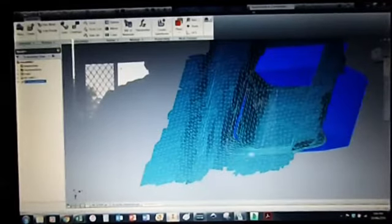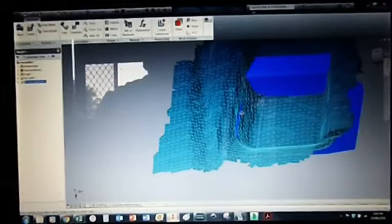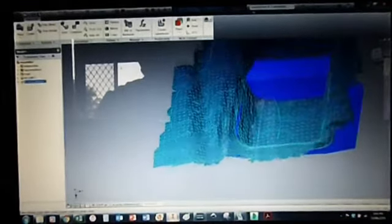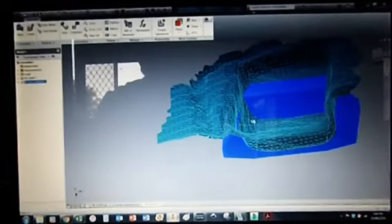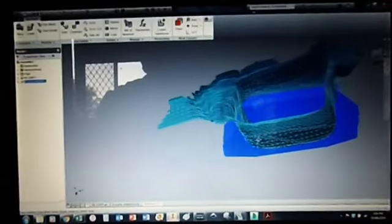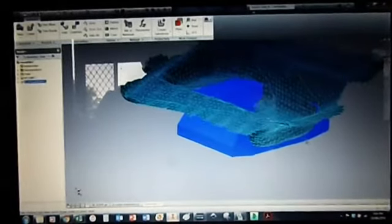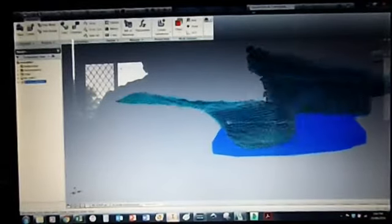Sort of playing with the idea of putting a separation plate in both sides of the wings. Just trying to make it harder for the oil to slosh away from the pickup. Just be like a plate with a series of laser cut holes in it. We'll see how it goes. Might get this cut first so I can work out where the rest of it goes, and then just continue on with it.